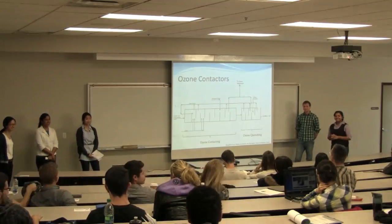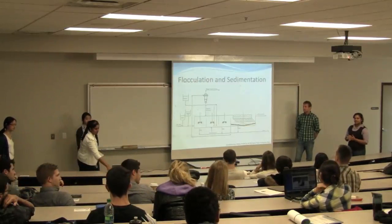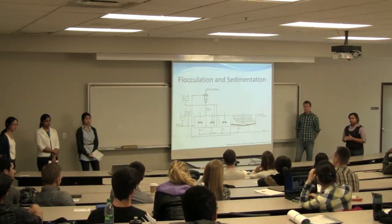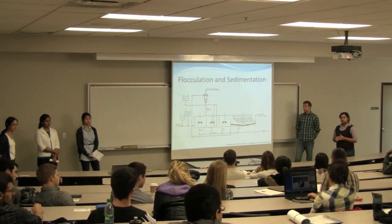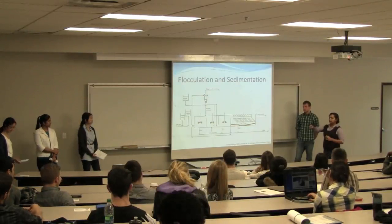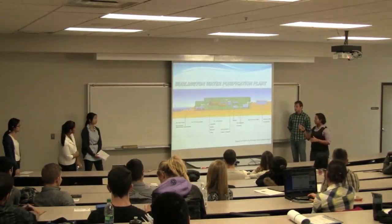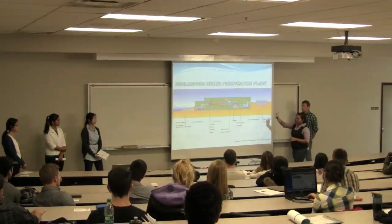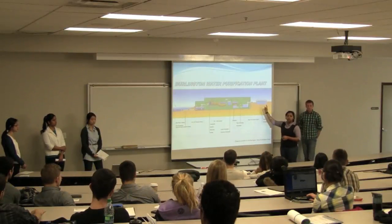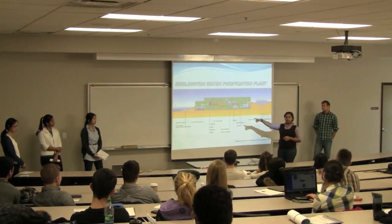The question on the size of the sedimentation vessel: you said that one of the vessels contains the reservoir at 90%, and you do that by changing the flow. Yeah, so the way that they regulate the outflow to the distribution tanks is through the high lift pump. And the inlet, the low lift pumps in the beginning, are variable. So depending on the demand sent to the distribution tank, the high lift pumps would change, and that would also change the variable pumps in the beginning.